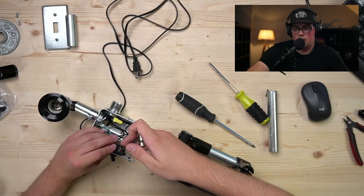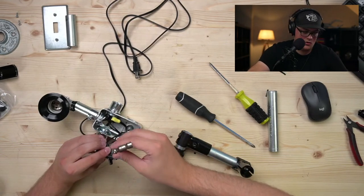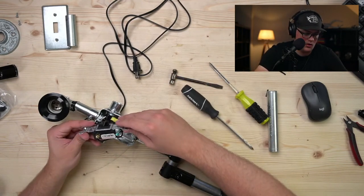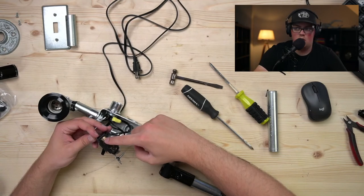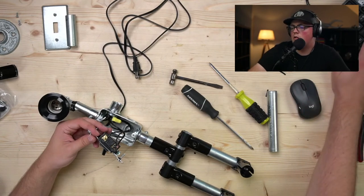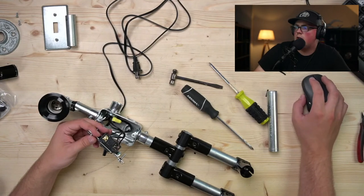Only the hot goes to the switch. The proper switch should only have two connectors, not including the green ground. Oh, okay. Yeah, we've got three on ours, Bob Clare. We've got one that's actually labeled common. That's why, and it's black, and that's why I thought that was going to be this one, the common. Yeah, there's some writing in the insulation that says common. And then there were two silver connectors or gold terminals. Yeah, two gold.